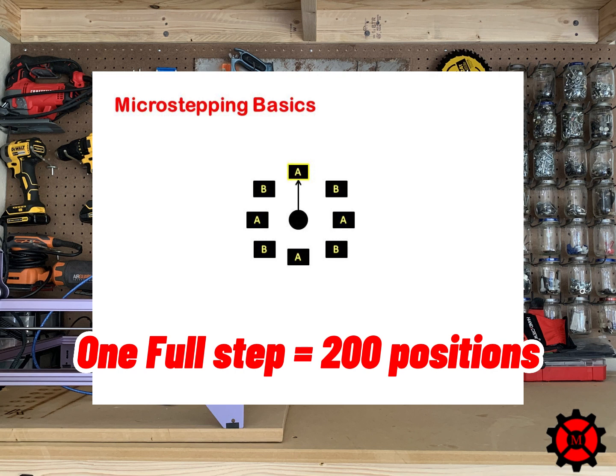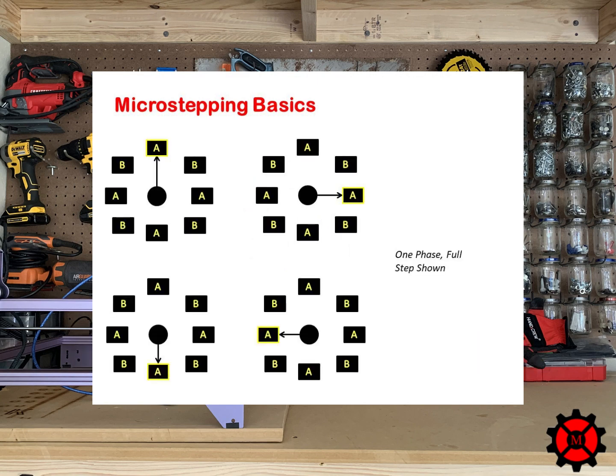There are a total of 200 steps in a typical stepper motor to complete a 360-degree rotation, meaning there are 200 positions in our circle. This diagram shows the one-phase full step where the motor operates with one phase energized at a time — achieved using the least power from your stepper driver. The two-phase on full step operates with both phases energized simultaneously, requiring twice as much power but delivering 30–40% more torque.